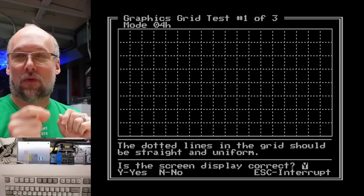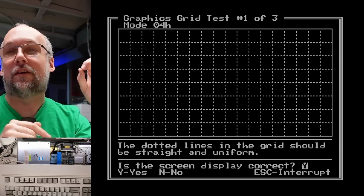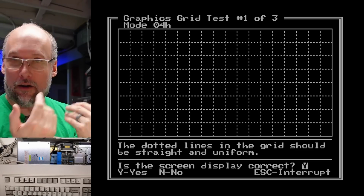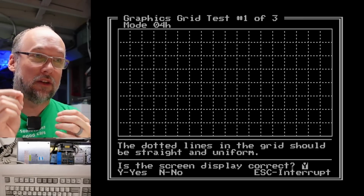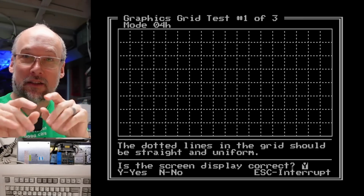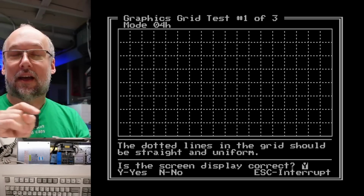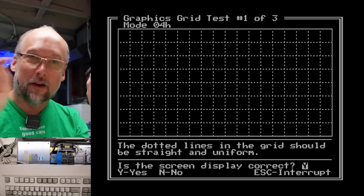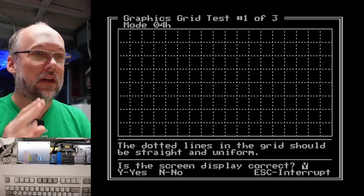And then what happens is when it goes to display your text screen, it says, oh, okay, the first character that I want to show is an A. And then it uses some special circuitry to read the character set out of the ROM, and it does that in real time. So it actually looks up, using address lines, the A character in the character ROM, and then it serializes that and displays the first line of pixels. It goes through and does all the other characters and then the next line and so on and so forth. So the circuitry that's involved is different.